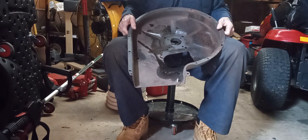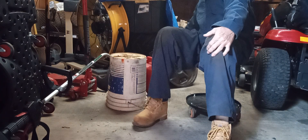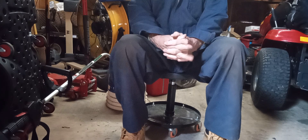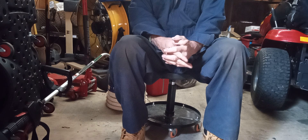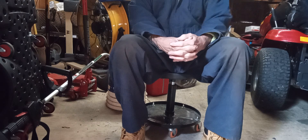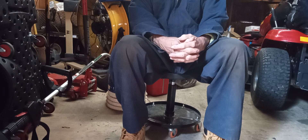The original engine on this chipper is a 1992 Briggs & Stratton 5-horse. The output shaft coming out of the back of the motor is one inch. The new engine I'm looking at has a shaft down to three quarters of an inch, so I've also got to order a special piece to convert from one inch down to three-quarter inch.